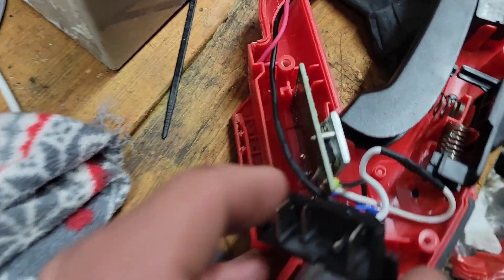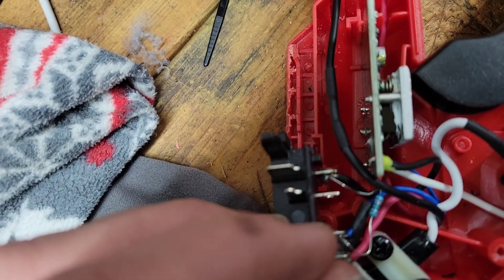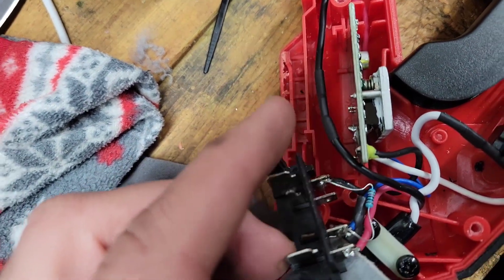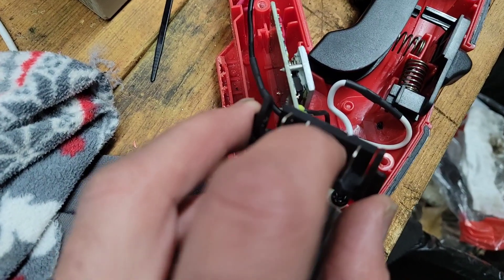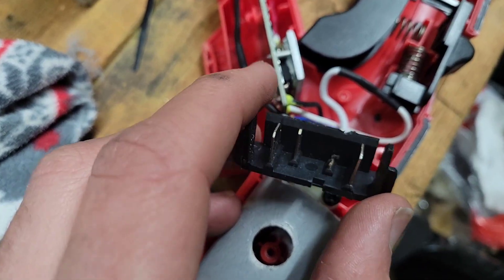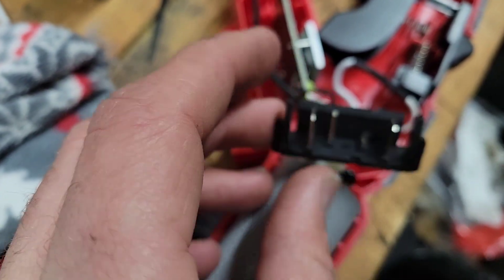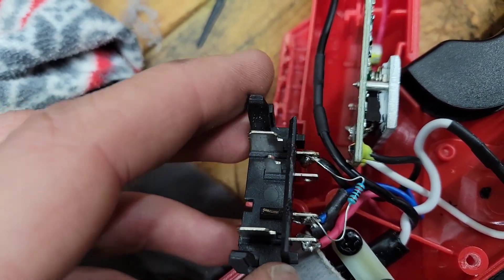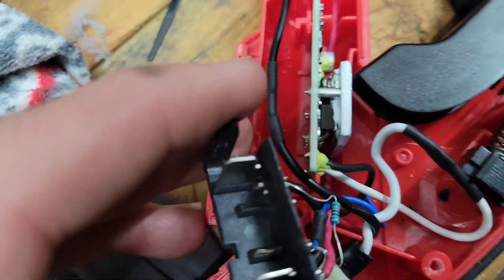You would think you'd just wire up the thermal resistor to the TH, which I did — the blue wire over to the negative. You can see my little resistor there, and you'd think that would be good enough, but it does not work until you break off this prong. I just read other people saying to do that. The resistor is still going from the blue wire to the negative, it's just not interacting with the DeWalt battery. So this makes it work.